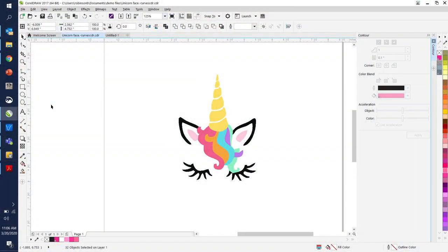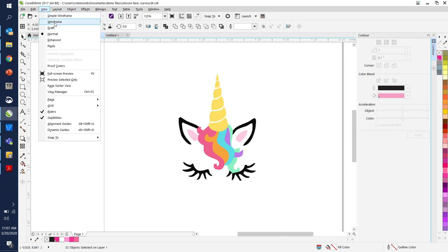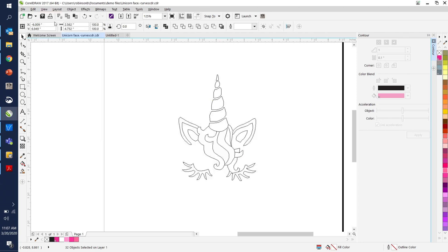Let's go to my screen. I grabbed a design off the internet, traced it — as you all do. Starting out, we need vector-type artwork. If you don't have vector, it's going to be very difficult, if not impossible. The machine will print raster or pixelated images, but vector is ideal. In CorelDRAW, if you hit wireframe view, you'll see lines — it basically looks like a coloring book that hasn't been filled in. That lets you know you have vector artwork. Otherwise it would be kind of grayed out and pixelated.